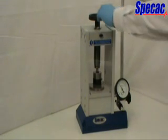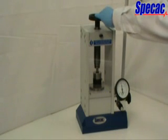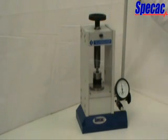It may take a few hand pumps to build up pressure in the oil, but once resistance is offered by the work to the raising of the piston, a tonnage load will be indicated on the load gauge. Keep on pumping until the required tonnage load is achieved. When the required tonnage load is indicated on the load gauge, stop pumping. The tonnage load and pressure of oil in the system can be held for as long as required.